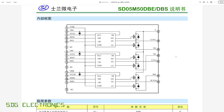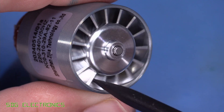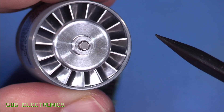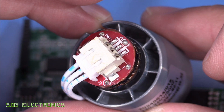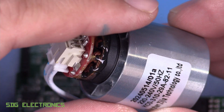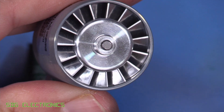There's no feedback on the motor, so it's driven completely open loop — basically hoping it spins. There will be some acceleration ramp associated with that; it won't just blast to full speed immediately on turn-on, but will be brought up gradually so it doesn't sit there skipping. The fan and motor are an integrated unit and look really nicely manufactured — a really high quality unit. You can see the windings at one end, connections off to the main board, and some fins inside to direct airflow. It looks like a really nice high-speed motor.